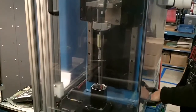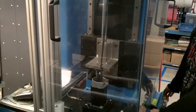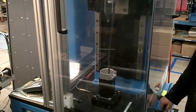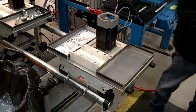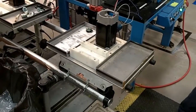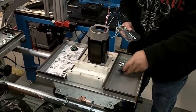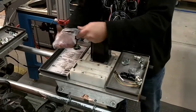With the major components completed, the final assembly of the motor can begin. An automated press assembles the shaft and rear plate to the motor's main housing. The motor is then transferred to an assembly tray. Remaining parts, such as motor labels, encoders, and connectors are kitted on the tray so that they are within easy reach for the assembly technician. This process also supports the assembly of custom motors by isolating the motor with any unique components.